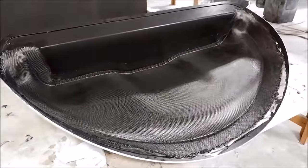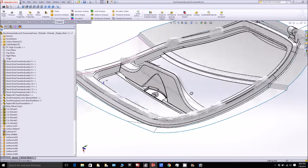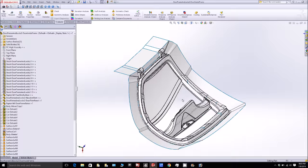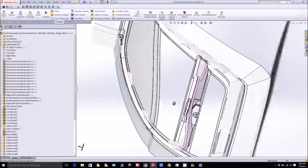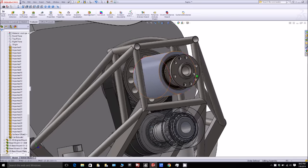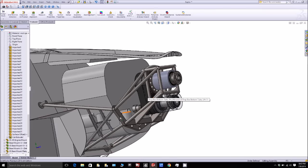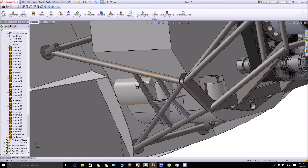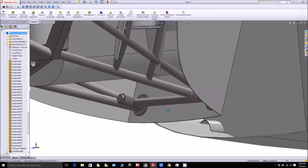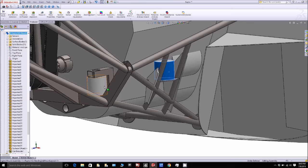On the CAD side I've been working on getting the door frame ready for milling — adding a bunch of flanges, cleaning things up, and figuring out how it's all going to be milled, trying to keep it simple where we can. Meanwhile Mark's been finishing off specifying all the separate parts that make up the belt drive system so we can start getting the custom pieces milled. He's also been working on a couple of changes to the engine mount to simplify that. You can see the air conditioning compressor placed in there just for location to make sure there are no collisions, and where the alternator lives, with four different engine mounts in place.